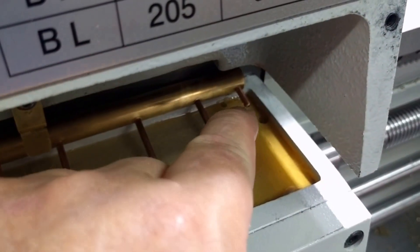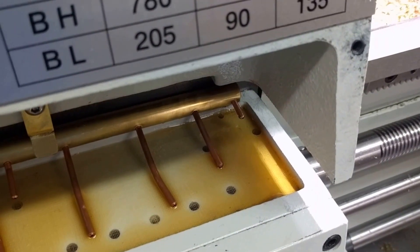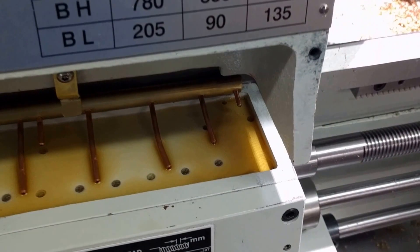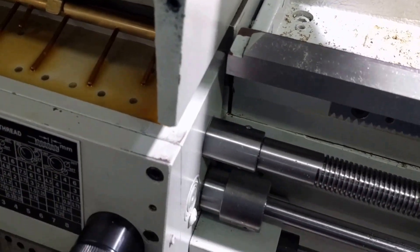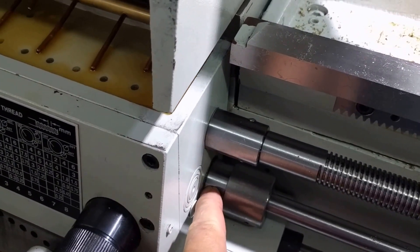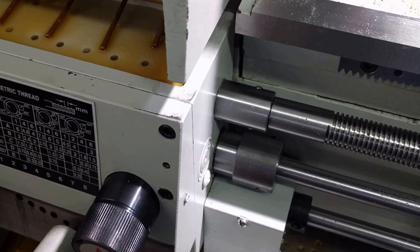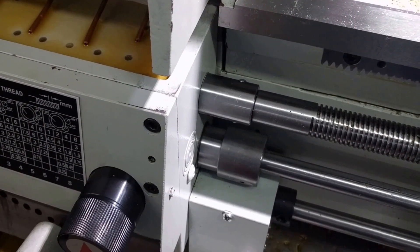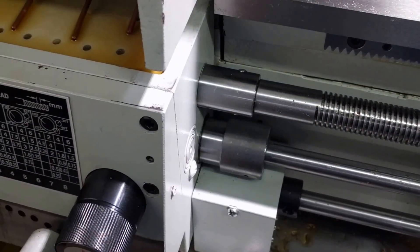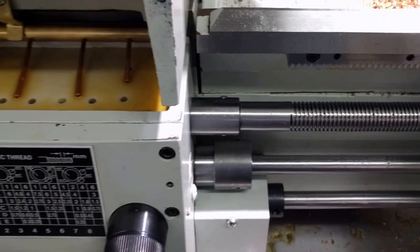What's really important to me — in the back right-hand corner you see those two ports. I oil the bearings to the lead screw and to the apron feed shaft. Those bearings see tough duty, a lot of wear and tear, so it's really important that they get proper lubrication. One of my buddies had a little bit of trouble with this one because the port had gotten stopped up and there was an issue. So important that they get oiling.